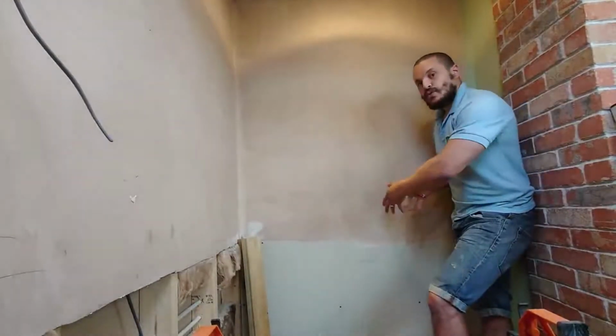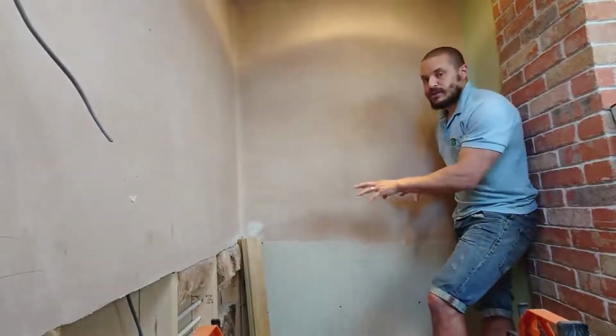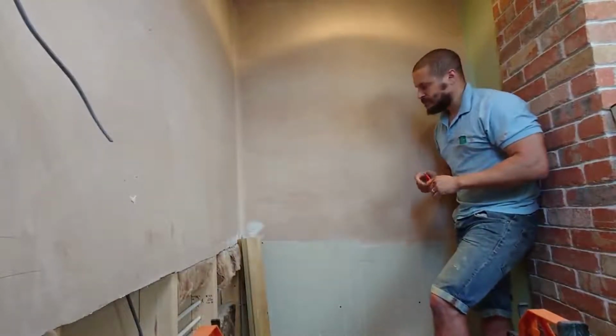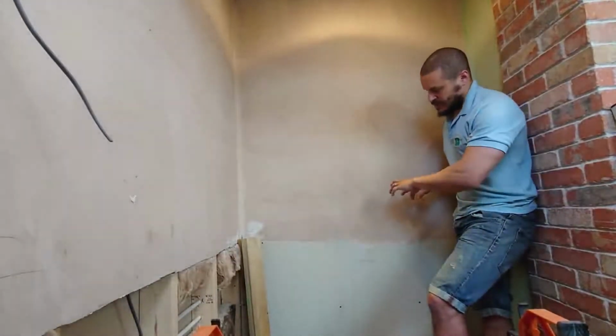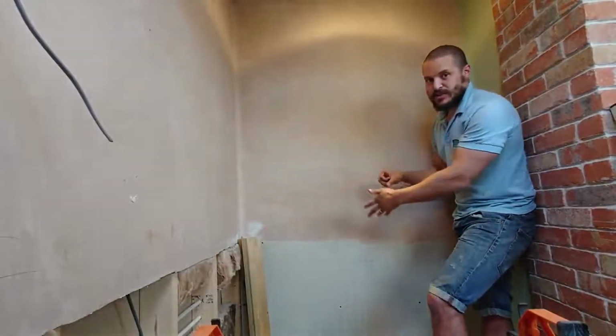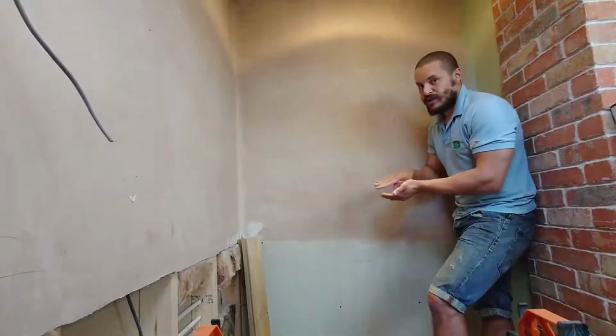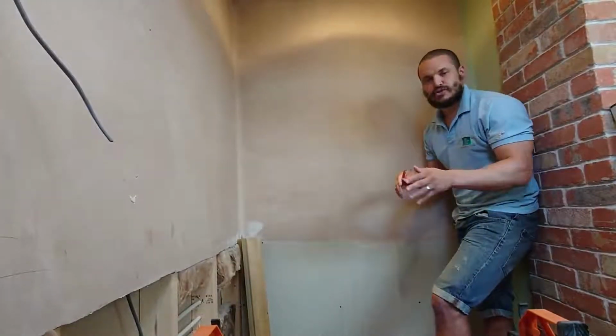One of the best videos I saw for this whole process, certainly for the structural element of it, was DIY Renovation. I'll put a link in the bottom of the videos. And in there he talks about creating your space, reinforcing where it's needed, but most importantly, at that first step, making sure you get the correct fall so water runs off, versus trying to do it at a later stage with tiles.